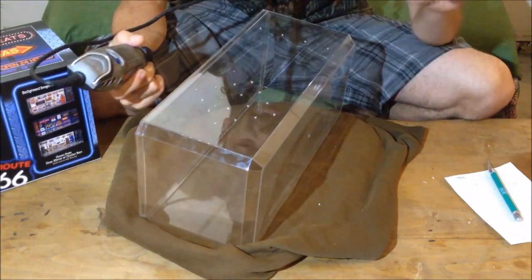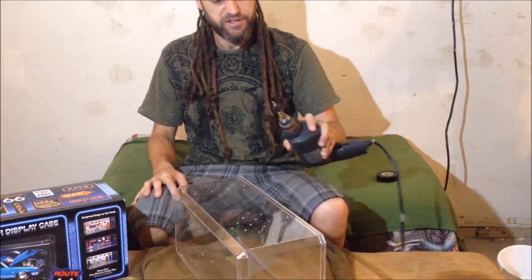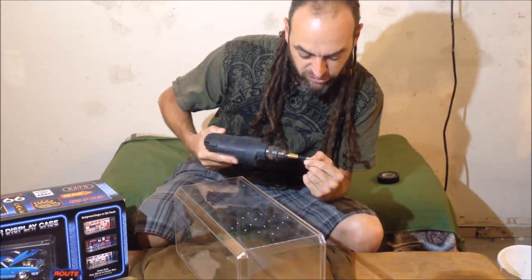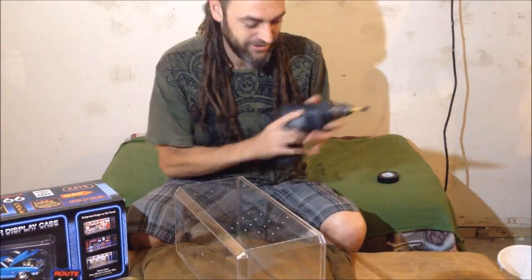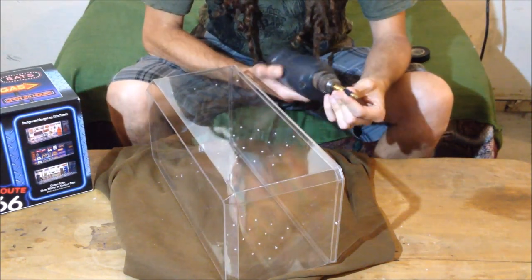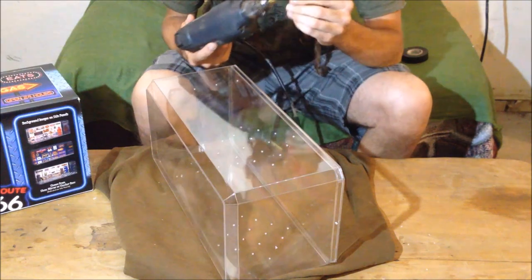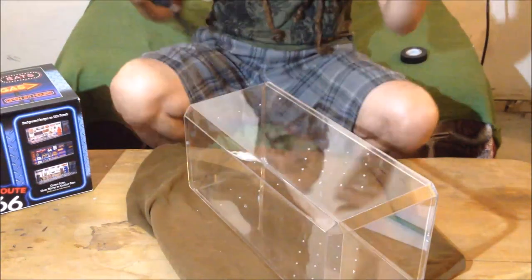I'm going to do the other side and come back when I start drilling with the stepper bit. All the little pilot holes are drilled with the Dremel — now moving on to the stepper bit. I'm making these holes at a quarter inch, which is what the holes are on my other large enclosures. My juvenile enclosures use 3/16ths holes. One thing I do to make it safer: put electrical tape on the next level of the stepper bit, so when it reaches the tape it stops at the right size and doesn't drill the hole too big or scuff around it.